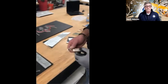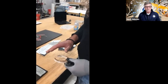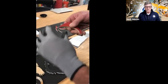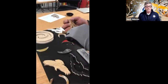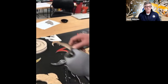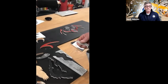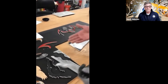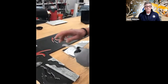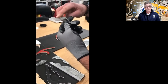One of the reasons I like to use the ring saw is you can obviously make tight turns. One thing really nice is you can get very sharp points without them blowing up. Even on very brittle materials such as onyx, you can still get a nice sharp point on it. I've been trying to use materials that are difficult to cut, that chip easily, or are just difficult pieces of material. But you can see with the ring saw, you can cut curves, very sharp points, and very minimal chipping.